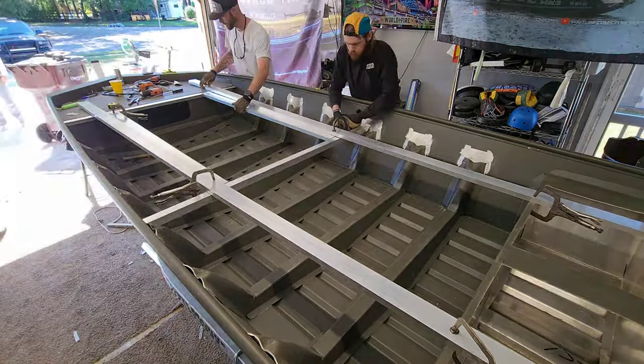But I'm also gonna throw something else in here. Since I brought this back to this point right here, I'm gonna throw a drop-in step here. It's gonna be half the distance of this. This is basically 12" from the top of the deck to where the floor is gonna sit. So we're gonna bring a 6-inch hatch in here, and it's gonna be cool because the way it drops in, it can drop down another 3" to get into this floor rib right here. But you can have some deeper storage for stuff he wants to put in there. This whole layout is really dope.